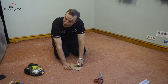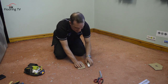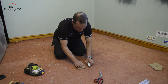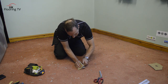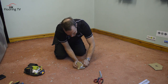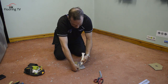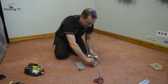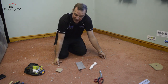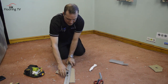I'll tell you a place where I've cut myself — when cutting around an architrave. If you've got your thumb on the floor and the knife slips, you're going to cut it. And if you're cutting towards yourself, make sure the path is clear and off the other carpet. When you're lifting something to cut it awkwardly, that tends to be when you stick the knife in yourself. The golden rule I got taught from day one: always cut away from you.